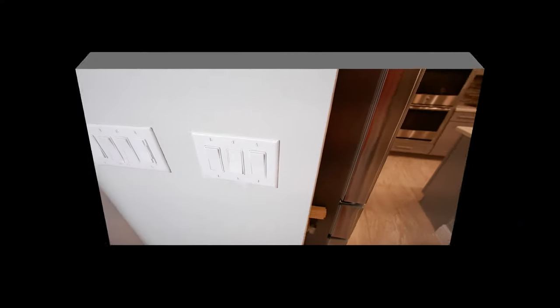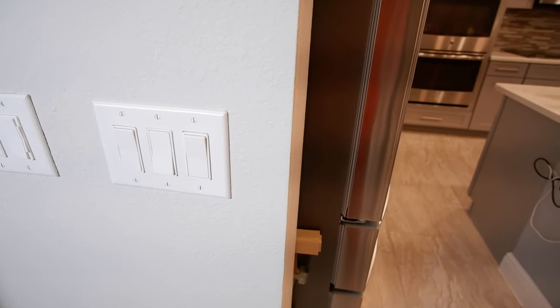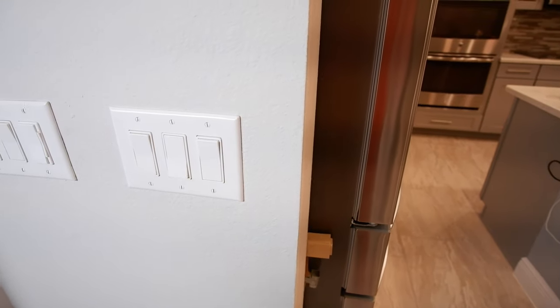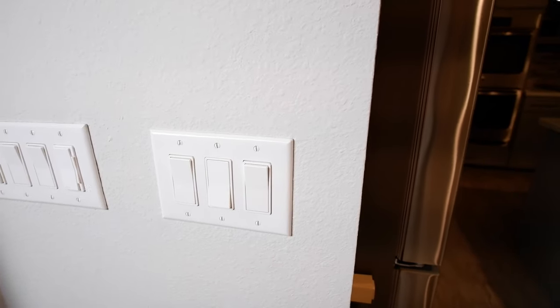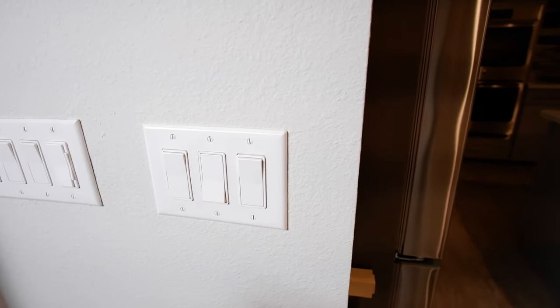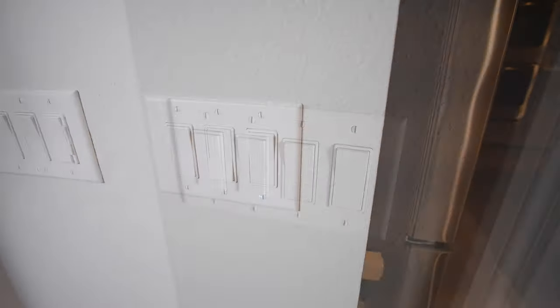Here's what we're working with today: we've got this three-gang that does the kitchen. I'll take care of that, and then there's a double-gang on the other side that does the three-way and also the breakfast nook. Before we start, make sure you turn off the power at the breaker for whatever you're working with. I'm in the kitchen and family room area, and the kitchen is on a separate circuit so I still have power and light behind me to work.